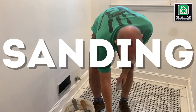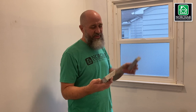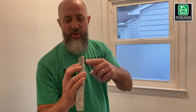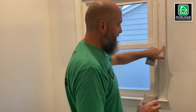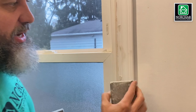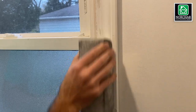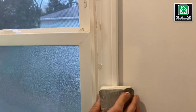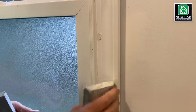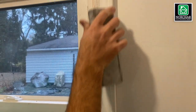Once it's dried, I'll show you how to sand it. I'm a big fan of the bigger sponge because it gives you more coverage, while the smaller sponge gives you more finger control. For sanding this nail hole on the trim — because it's drywall spackle it sands quickly and easily, and once there's paint on it, it'll be as hard as the rest of the trim.